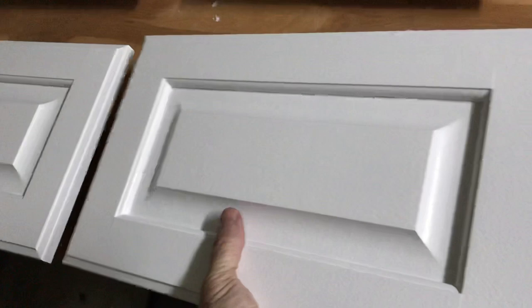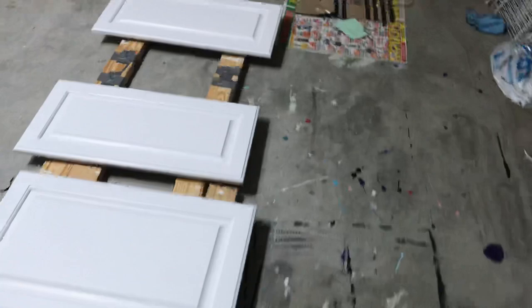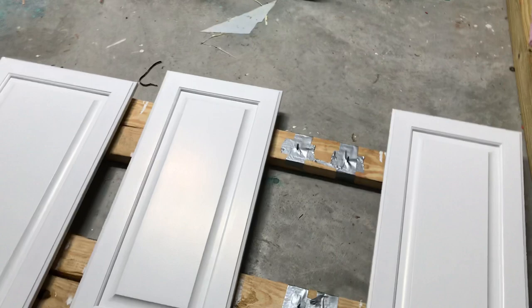What's awesome about it is it lets you set the door down — you can paint one side and set it down and paint the other side and just let it dry like that. You can't even see any marks where the nails are, and it allows you to do the paint project about twice as fast as if you had to wait for one side to dry completely. Over here I've got the larger doors with two-by-fours in different configurations for varying widths, and on these larger doors I used a cross-shaped piece of duct tape to make the nail more stable.